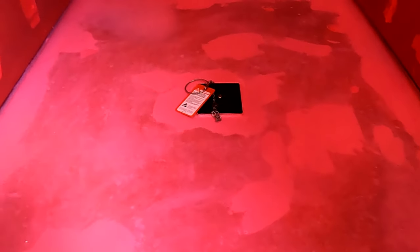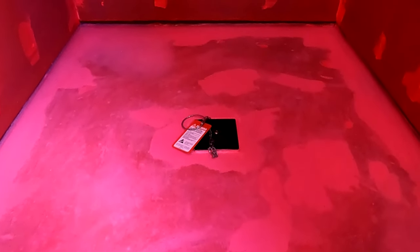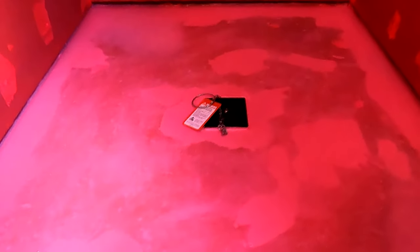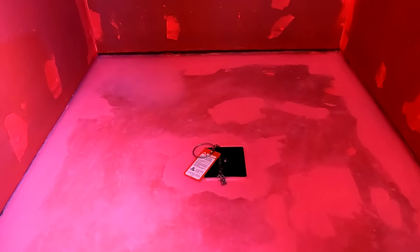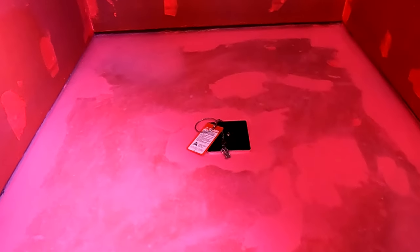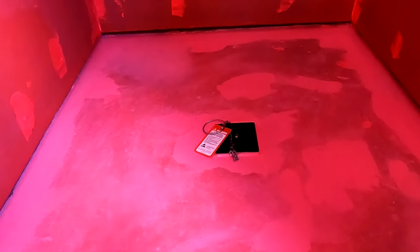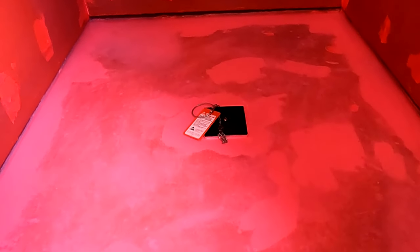I have a different take on that. I've talked about it enough so I'm not going to go into the pre-slope, but that's the water-in water-out method we did back in the day. Going forward, there are a lot of things I've been ahead of the game on. I started doing blocking 22 years ago — blocking between the studs with 2x6 — because when I tore showers out I never saw it. The seal system which everybody's doing now makes the whole pre-slope notion irrelevant.